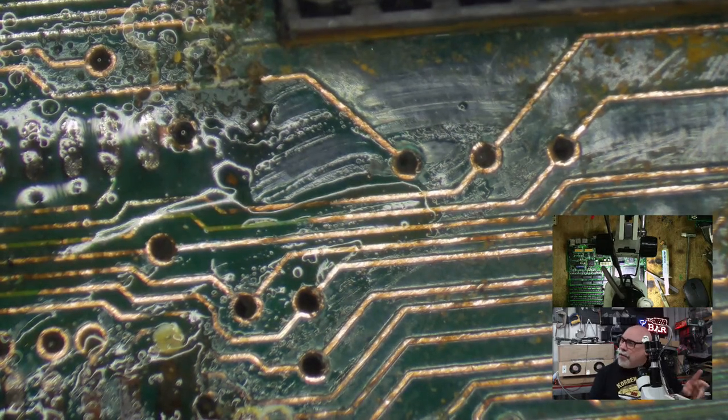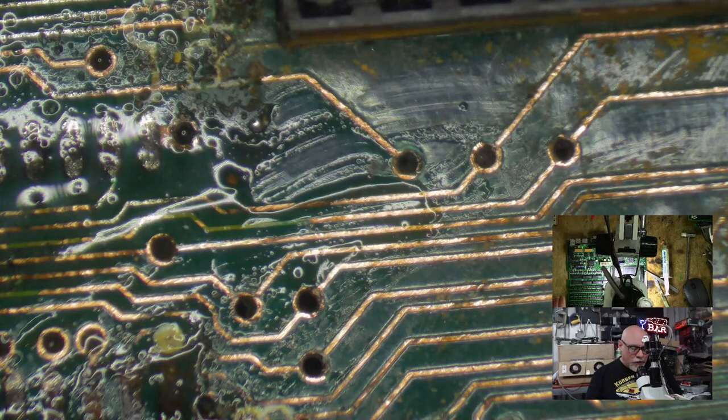Interesting thing about the SE30 board: a lot of the boards that are out there are 4-layer boards, and you have data lines on the top, data lines on the bottom, and then inside you have two layers, usually one for ground and one for power, your voltage rail. The SE30, because they were basically cramming, I think a Mac IIx, into this very small board, instead of being a four-layer board, it is a six-layer board. So it has the same as before, data lines on the top, data lines on the bottom, and a voltage rail and a ground rail inside.